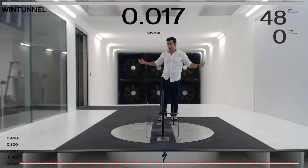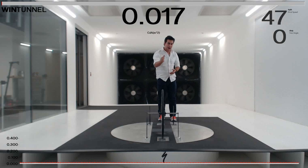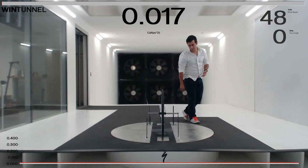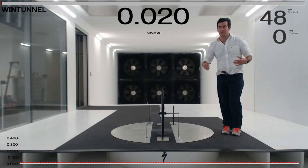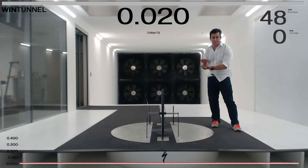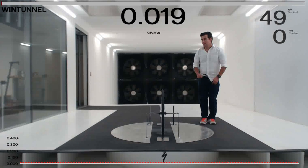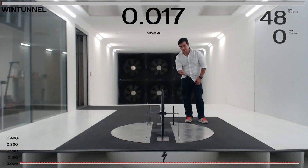Our test section is very big. If we wanted to look at multiple riders, we could put a rider in front of this balance that's measuring the drag and actually look at some drafting effects. Right now we just have a wheel strapped to the balance, which for lack of a better term is like a fancy bathroom scale — except with the precision of a kitchen scale. So I can measure basically the sensitivity of a paper clip.